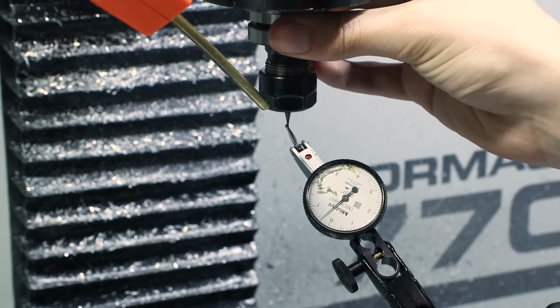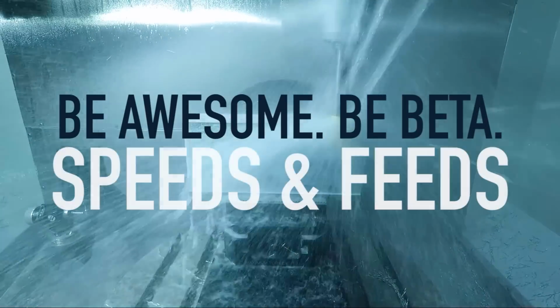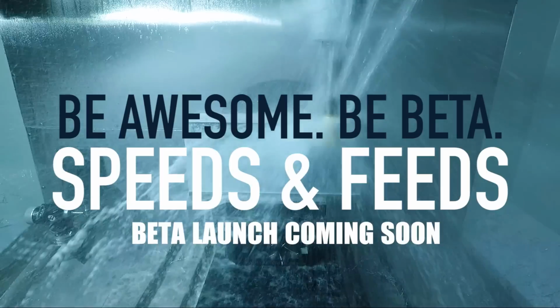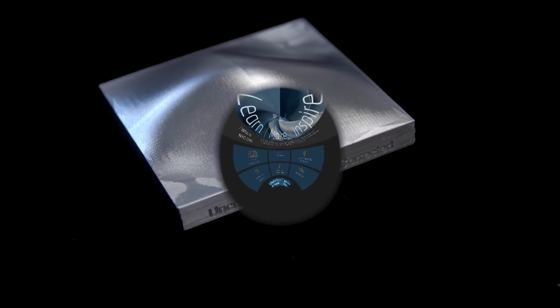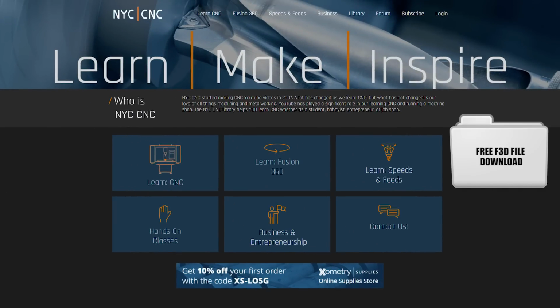Don't make assumptions. With our new Speeds and Feeds project, we're checking runout all the time, which is why we ended up going with the Spironi. It's so much easier to check it with that machine in a non-contact way, very quick, very efficient, very accurate, versus having to use indicators and line it up. The difference, of course, is that checking on the Spironi tells you the runout stack within that tool holder, which can still change depending on how the tool holder is mounted in your spindle.